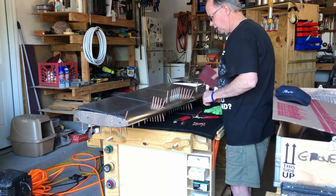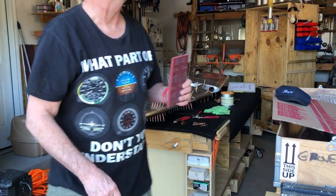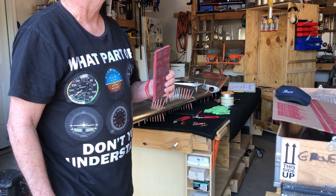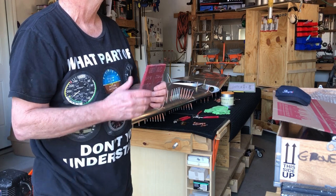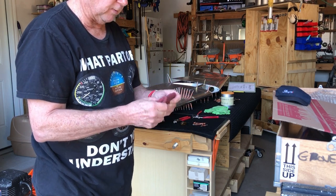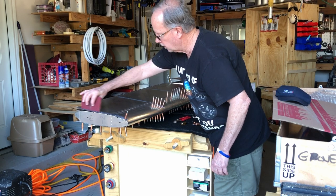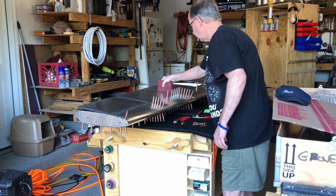And the other thing is I did go ahead with this 3M, let's see, it's a hand pad, Scotch-Brite 3M. They are 7447 Pro, and the product number is 64926. Scotch-Brite finishing strong pads. And Evan in his videos always says to take these and scuff all along where you are going to dimple and Cleco. I've already pre-done this on these skins, so I don't need to do it again.